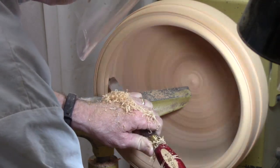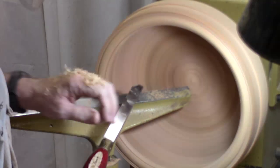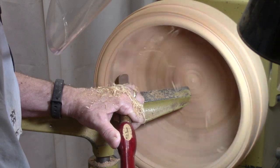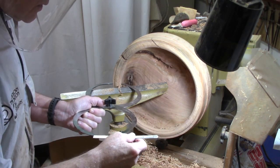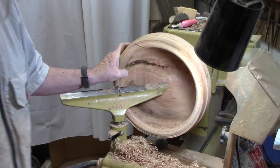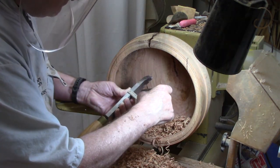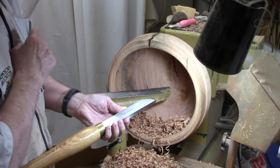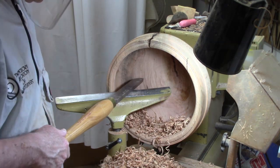That's definitely cleaning it up — getting rid of those large tool marks which would be very difficult to sand. Now going flat on this surface. I can measure the distance between and it's still one inch, so I've still got a quarter of an inch I'd like to remove. Going back to the largest scraper I have — about half an inch thick and one inch wide — it has a lot of mass. I'm going to pick it up along the bottom and try to get rid of some of these tool marks.